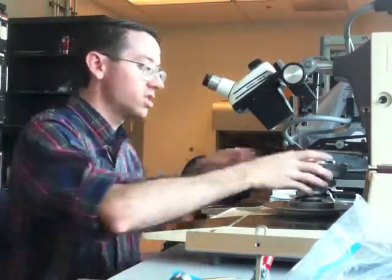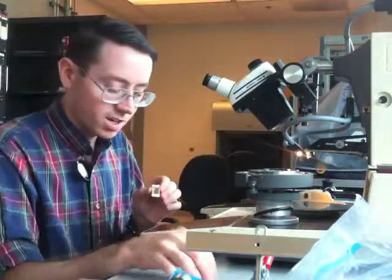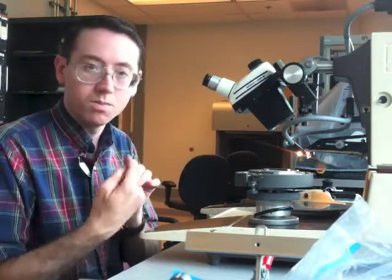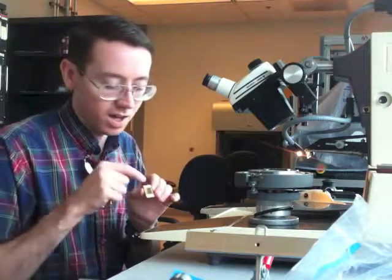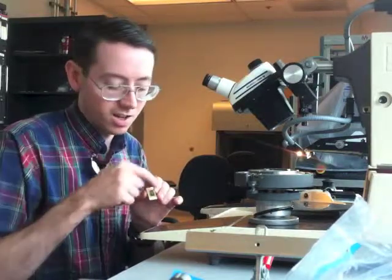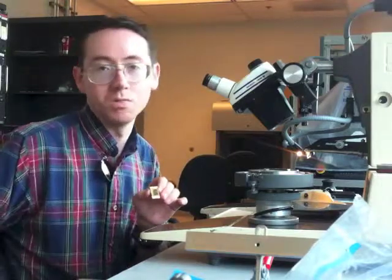One other thing: when you're placing your chips on the DIPs, try to identify the features that you want to get to and put those contacts in the center of your DIP when you glue it in. That way you have the same distance from side to side. The longer the distance you have to traverse, the harder it will be.